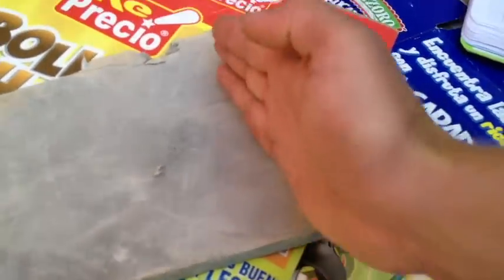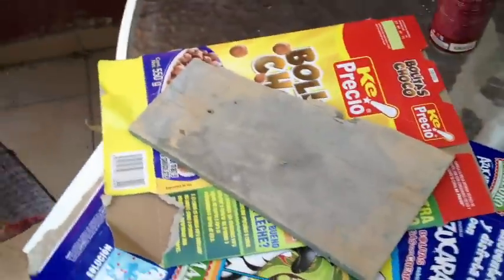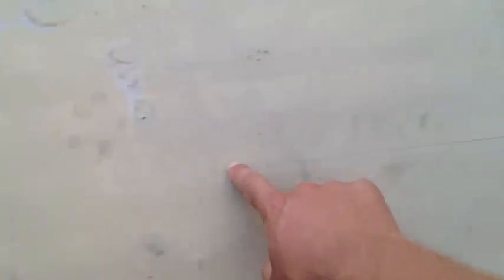And with this edge here, it's okay if there's a rip here because we're cutting a curve out like this, and this all is going to get cut out. But here, this edge has to be extra straight. This really has to be straight because this is what's going to lie on the support in the back. And if you tilt it, then you have it go like this and like that, and all the sun is going to miss the can. So you need one long straight edge.